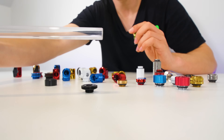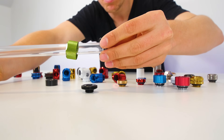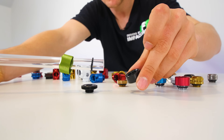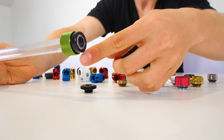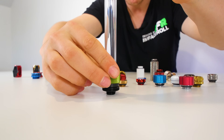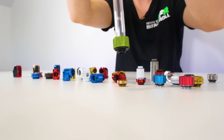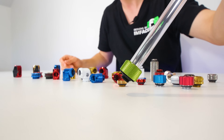The benefit is the tube goes all the way into the fitting with no gaps and won't come loose. To assemble: first put the compression ring over the tube, then place the o-ring over the tube for a watertight seal. Next, push the tube into the inner ring section until it's flush, then rest the assembly on the fitting body and tighten everything up. That creates the perfect tube depth inside the fitting, with four o-rings preventing any leaking. It's a great new concept on the market.